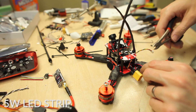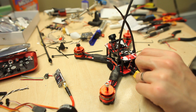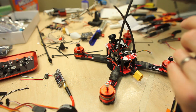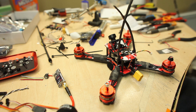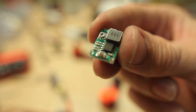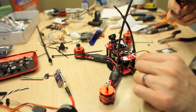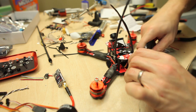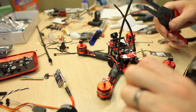Looks okay. The LED light is from Banggood - it's a really cheap one and a really bright one, but it only accepts something like 3 volts. So I will be using an adjustable step-down from Banggood also. It's a really cheap one. There's a small screw to adjust the voltage. You'll need one if you want to use the small LED lights from Banggood. This small cable is outputting full voltage from the 4S or 5S lipo I'll be using with this copter.